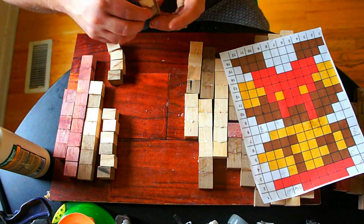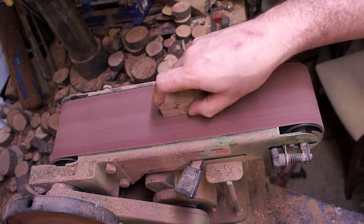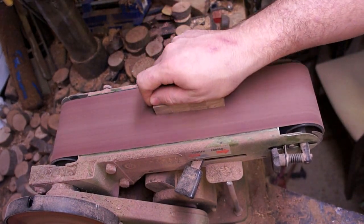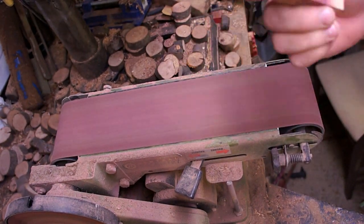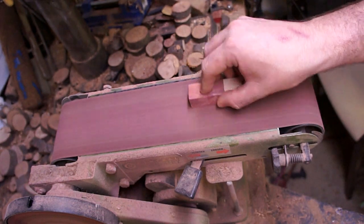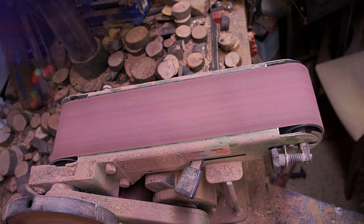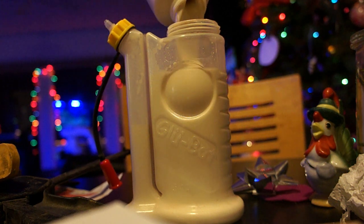All these lines you see here — I'm actually going to have to go back and do that same sort of sanding on them after they're all glued together and dried, to really dial them in a little bit more and get more of the inconsistencies out. It's going to kind of be a theme of the glue-up of this whole piece — really just doing a lot of sanding and finishing. One of the problems I came up with is that a lot of the woods were different hardnesses, so some would sand quicker than others. Especially if there was one on one side and it wasn't symmetrical, I'd sometimes run into issues with the line going a little bit off-kilter.